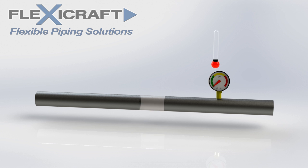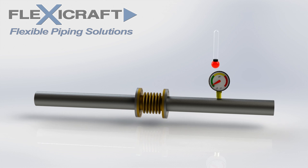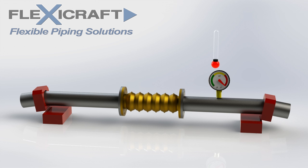But if we cut a hole in the same pipe and add an expansion joint, we have a model like the bendable straw. Now when we again pressurize the unanchored system, we can see the joint will stretch out to failure because it's not stiff like the pipe. When we now add back the pipe anchors and again pressurize, the joint does not stretch out from the thrust load because the anchors are preventing that. But if the anchors are not designed to withstand the new load, they can fail and consequently allow the joint to stretch out and also fail.